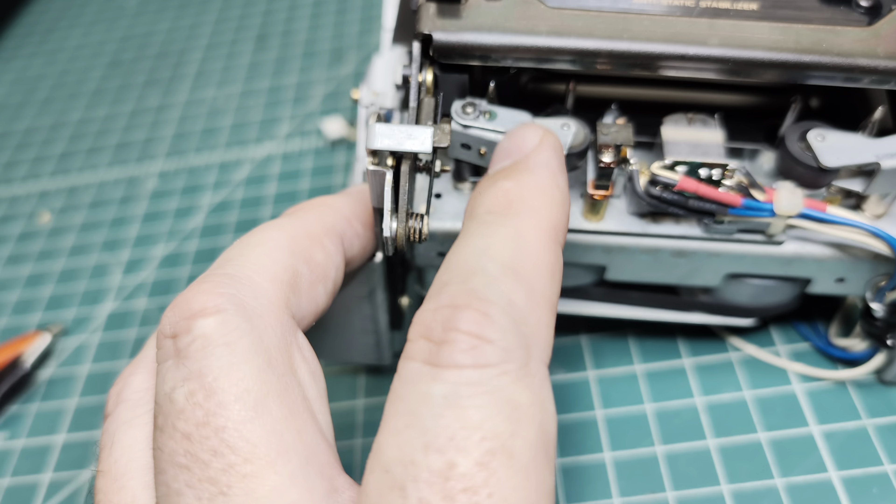It really shows like three hertz, three and a half, and seven hertz — two main frequencies. That's typical when they are not balanced. I checked the belt, the capstan surface on the back, the capstan shaft surface on the front, belts, how well it pulls — everything. And it still doesn't give me lower values.